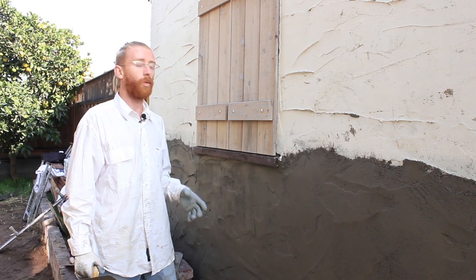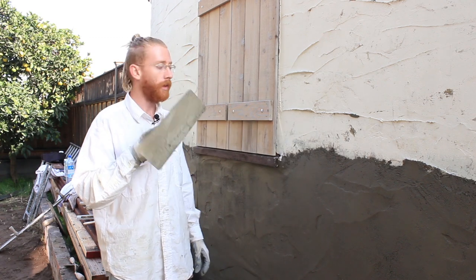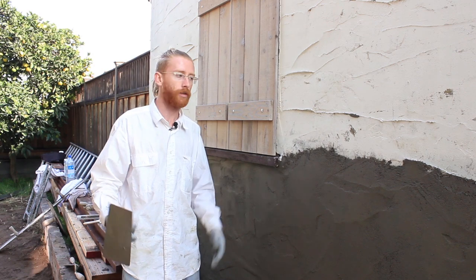It's been about three hours. Why did it take so long to dry? We put it over a painted surface, we put a bonding agent, then we spread — and there's nowhere for that moisture to go. It's a real cold day, so it just takes a little while.